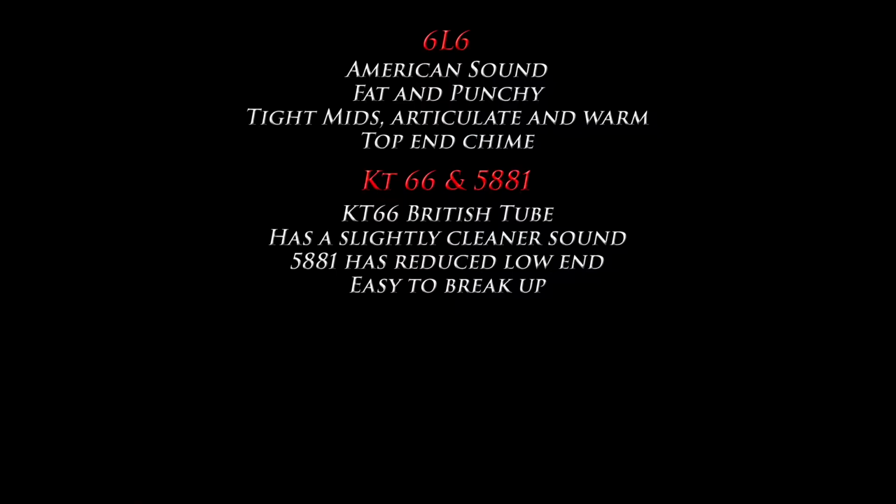And what it will do is it will give you a cleaner tone. If you like to drive your amp really hard, this one will not break up as soon as a 6L6, even though a 6L6 is very hard to break up. Now you can use a 5881 in place of a 6L6. And what a 5881 is going to do is it's going to give you less low end frequency response, but it has a much quicker breakup.